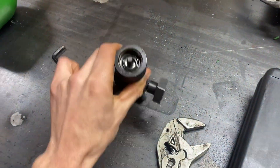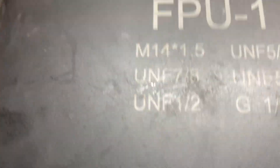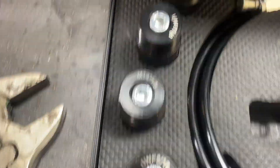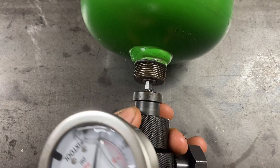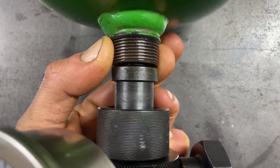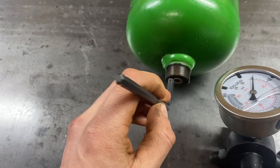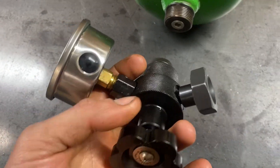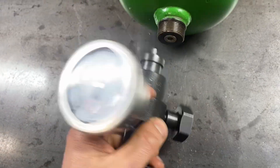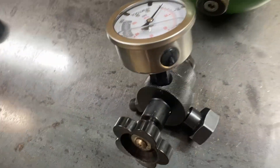The main thing you need to know is that your kit has to have an M28 by 1.5 adapter — that's what this Bear tool is. It's got all these other adapters in here that I'll probably never need. The hex on the charging kit slides in spring-loaded, and then you thread that collar onto there, and it charges around that screw to charge your accumulator up. You'll use your 6mm to crack the valve loose, thread your tool on, and use the hand valve to open and close under pressure. This fitting here releases the pressure held in the tool.